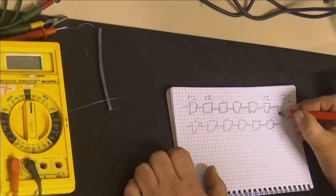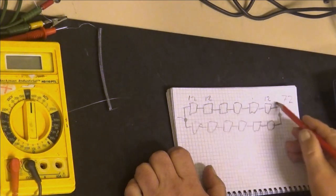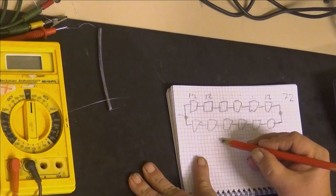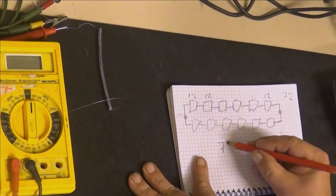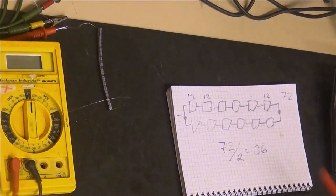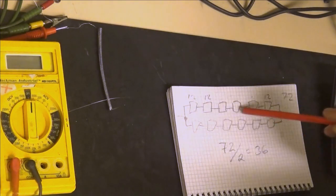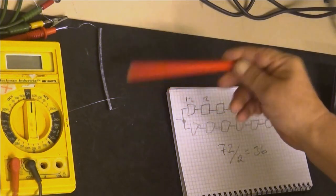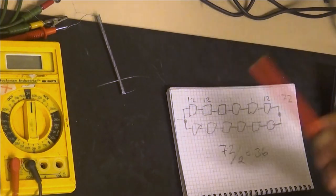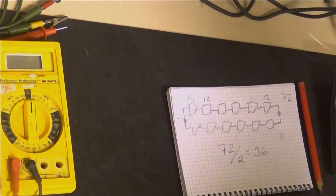and then connect these in parallel like this, so in this case we have two 72 ohm resistors, but since they are in parallel, it means that we have to divide, because they are equal, so it's 72 per 2 equals 36 ohms. So that's the configuration we are going to need. Now we are getting a lot more power, 4 times more. We need 1, 2, 3, 4, 5, 6, 7, 8, 9, 10, 12 of these. Yeah. I will now do 11 more of these.